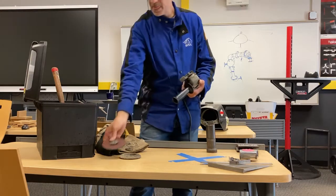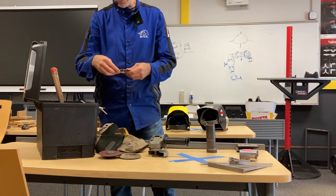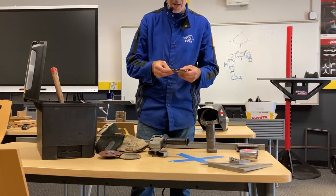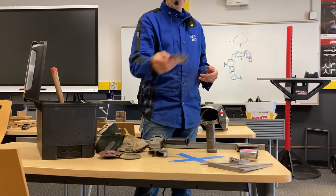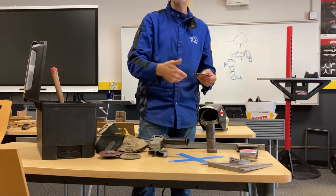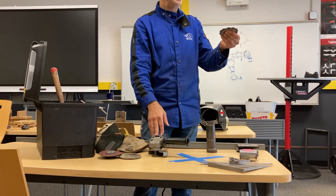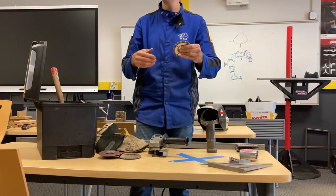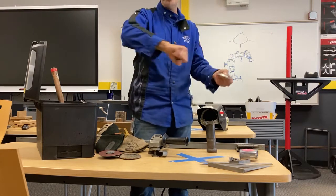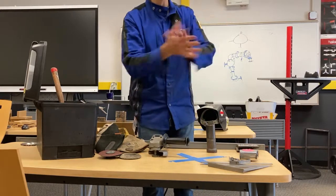I also brought in the most lethal tool in my arsenal — a chainsaw wheel that mounts on the grinder, enabling you to carve wood like it wasn't even there. If you imagine the kickback issues with a grinder, now imagine one operating at 20,000 RPM with a chainsaw attached. It's a very cool tool — you can carve wood and go right through it — but very dangerous. A grinder is a must, and you don't want to cheap out on these things.